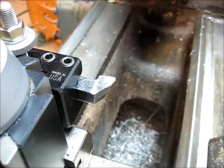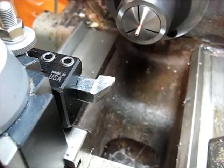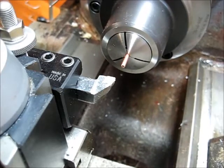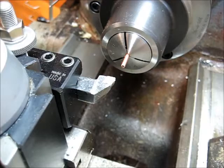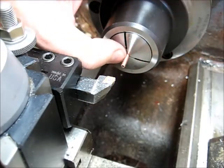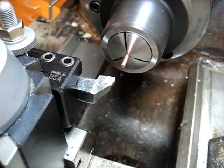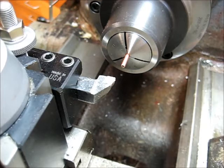All right, with the lathe here, we've got a 1/8 inch 5C in the collet chuck. We got our little 1/8 inch OD copper tubes, and all I'm going to do is clean the end up. Take the very slightest, like not even measured. If I'm changing the color, that's all I want to do, is skim that end off there.